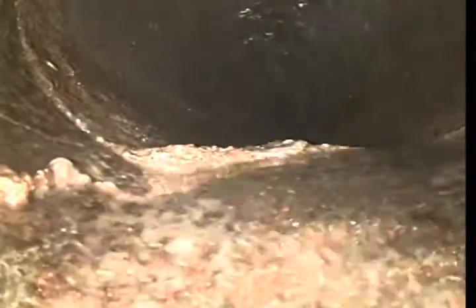It's a large pipe, and now we are coming back towards the house. There's a little bit of water here due to some accumulation of debris or waste on the bottom of the line. It doesn't mean the line is backed up — it's just some debris on the bottom, which is common with sewer lines. We normally check the joint connections, how they look, if there are major offsets, or anything that doesn't look common. Roots are very prevalent on sewer lines. You can see some excess concrete on the bottom, which is normal from when the pipe was installed.